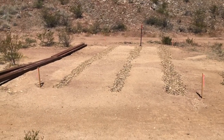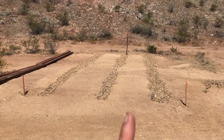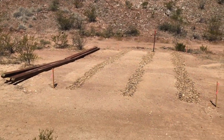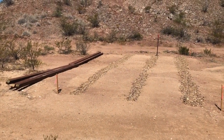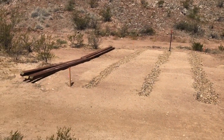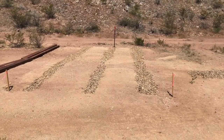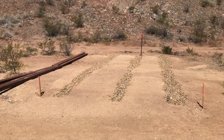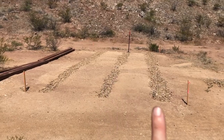The water won't sit there, and they are treated skids - you can see the skids over there. This is going to be a 12 by 24 shed, 24 feet long in that direction, and the skids are going to run that whole 24 feet. There will be three of them, made of two 12-foot pieces spliced together using treated 2x4s as little braces. I'm also going to connect them with cross braces that are 4x4s cut to fit at three locations along that length.